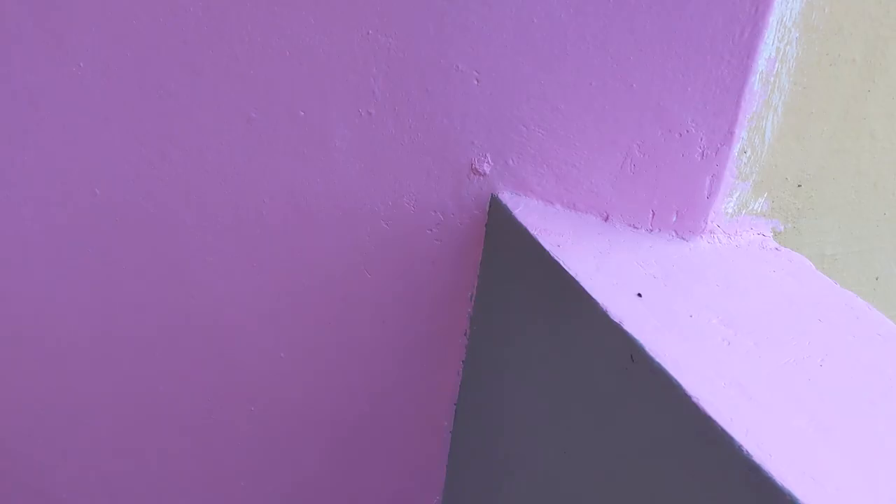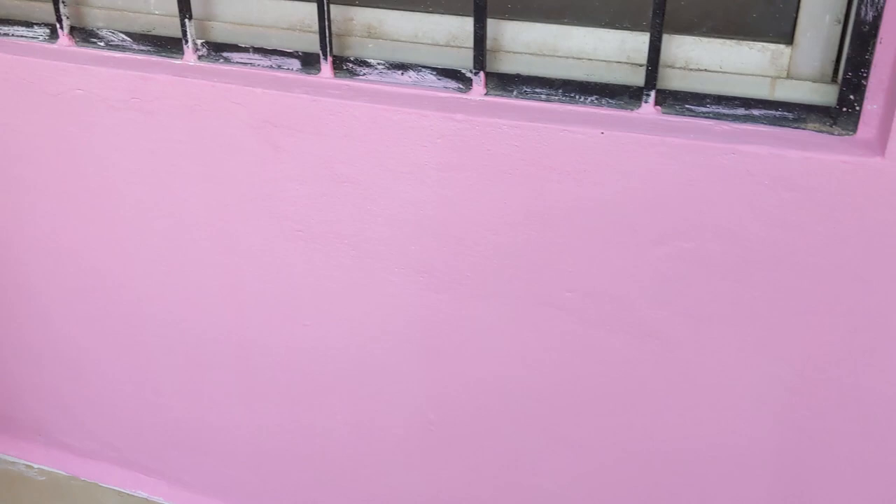So friends, after three days of work we completed the painting of the balcony — a few hours of three days, I would say — because it's not only about painting two coats, but we had to remove the older paint and then there was a lot of wall putty to be applied and scrubbing. The putty had to be dried and then scraped, and then one coat of painting that had to dry, and again the next coat. Overall it took three days, and we managed to do this with whatever little paint we had after our bedroom makeover. We have done a decent job and we have got the hang of painting now, both myself and my son. We really enjoyed doing it. Looks like if we had more paint, we would have even done other rooms as well.